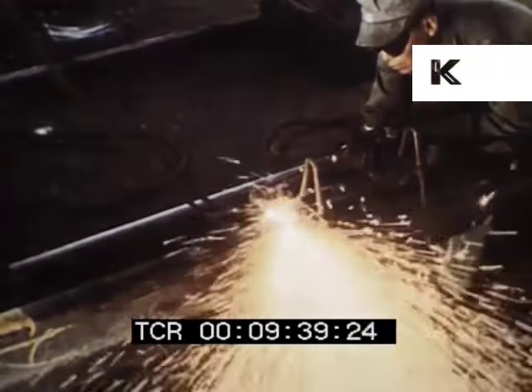Moving along, the rail is normalized in a machine which also has blocks of tips to direct flame to all parts of the weld. The normalizing machine has a six-inch stroke. To allow the weld to cool after normalizing, the string of welded rail is taken along for 178 feet before it reaches the first grinding station. In the initial grinding operation, excess metal is removed from the top and sides of the ball of the rail. The grinding machine has a five-horsepower electric motor and a two-inch by eight-inch grinding wheel. In the next operation, excess metal is ground from the base of the rail at the weld — a hand operation depending on the skill of the operator.